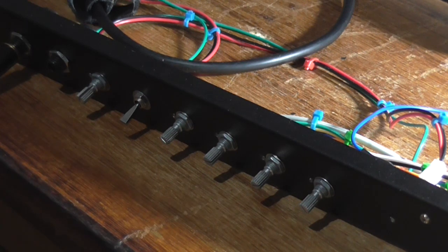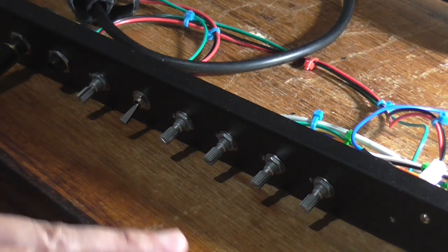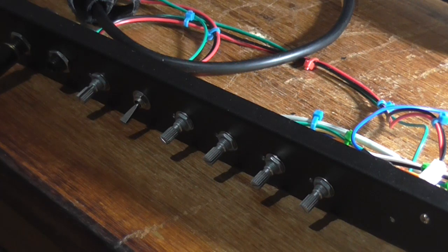wiper or the center lead before the rest of the circuit, or else you're going to end up with the problems I did. I think Rod Elliott did mention in his text somewhere that you should really consider putting a capacitor between the master volume control and the rest of the circuitry to prevent DC going into it, but I have to reread it. Because I was going to email him and tell him my findings with his current layout, that he may want to consider changing the circuit board for a revision C, or whatever it is now.